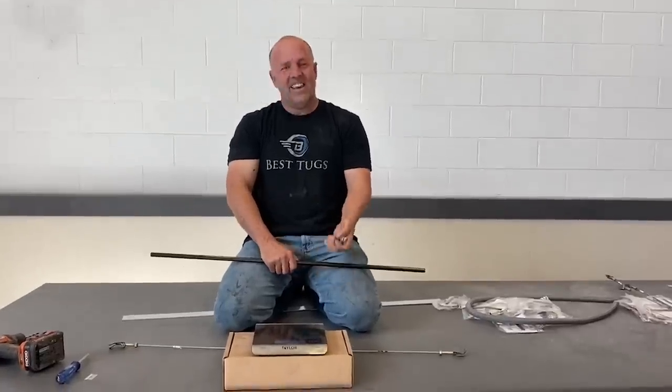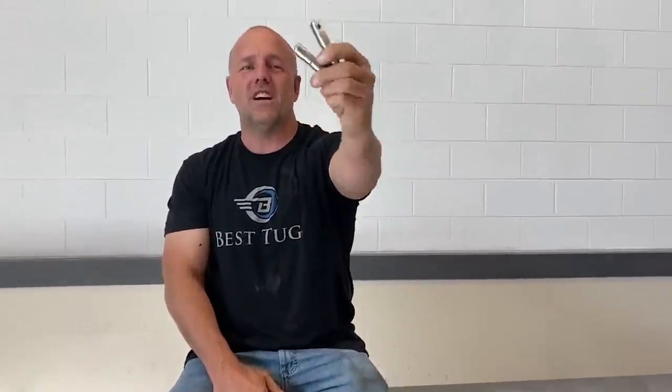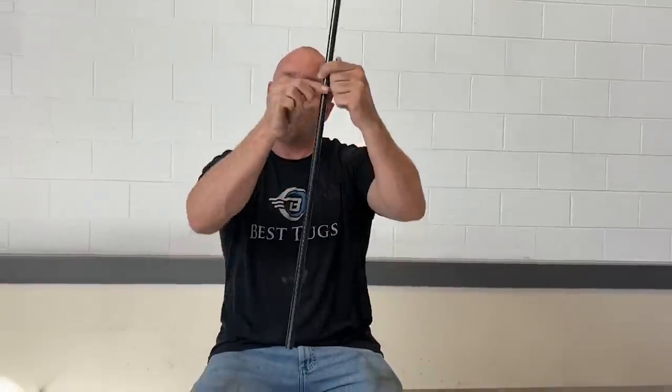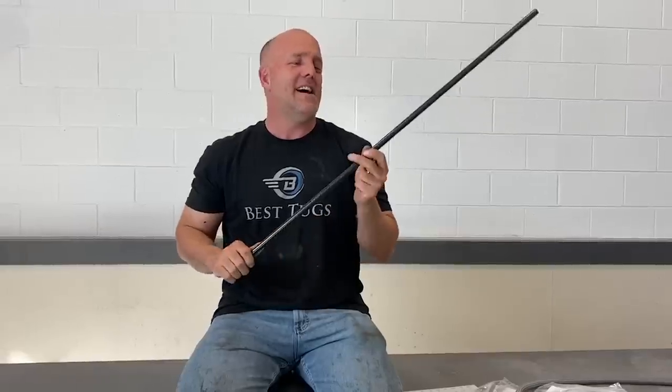Okay guys, now that I've just got these machined up, these are my new ends. They're two different kinds, one for adjustment, one to lock my tube from rotating because I'm going to put a little flying wing on it for aerodynamics. Tubes suck and airfoil will help. We want to know what's the weight difference. I'm trying to get a much stronger part that doesn't need adjustment, that can't stretch or ever loosen. And let's see how much more weight I'm going to have to carry to do that.